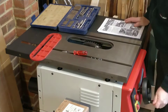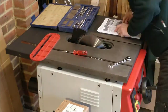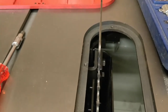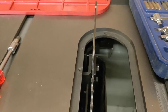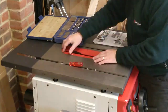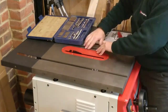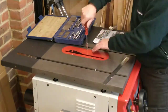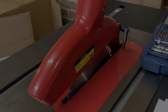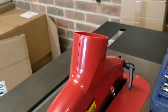The cast iron insert plate is fixed down with five Phillips cross-head screws — not the more commonly used Pozi drive. I remove this, raise the blade, and fit the riving knife. There are grub screws to align the riving knife to the blade, but from the factory it was perfect. I then adjust the insert plate to make it level with the bed using the grub screws either side of each fixing screw. After some trial and error I got the plate perfectly flat with respect to the cast iron bed. I then refit the crown guard, which is held on with a hand nut and is quite easy to adjust once on.